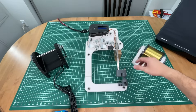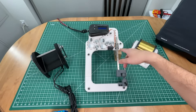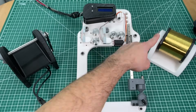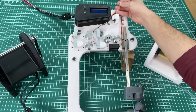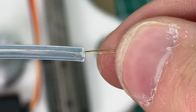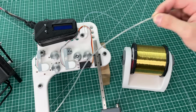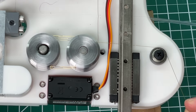And there it is — the finished product. It starts over here with the spool of unused brass wire. The wire is fed all through this contraption before being excreted and collected with the re-spooler, which is driven by the stepper driver receiving commands from our control box. To feed our brass wire into the mainframe we use clear Teflon tubes which push into their designated holders on the frame. To fit the brass wire into the Teflon tube, it's far easier to fold the brass wire in half and then push it in — otherwise the brass just kinks and doesn't travel further into the tube.